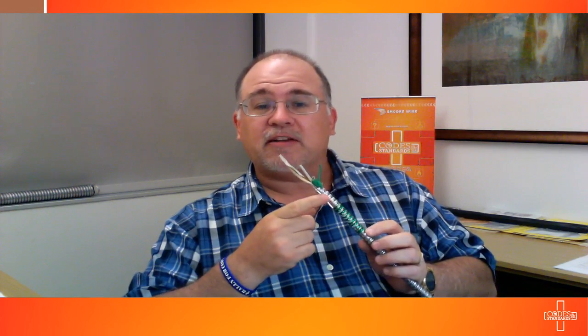So what makes a Smart Ground a healthcare facility cable? What we do is create a Smart Ground product by putting the aluminum grounding/bonding conductor inside the system, but then we also add back an insulated equipment grounding conductor. In accordance with the National Electrical Code, in order to be used in a healthcare facility — most notably for receptacles and fixed electrical equipment in a patient care space — you have to have something called redundancy. There's a specific section within the NEC: 517.13 A and B, which gives us the guidelines for using this type of product in patient care spaces.